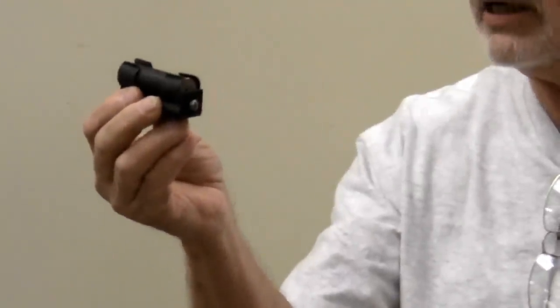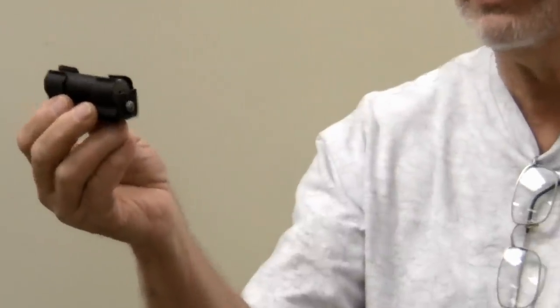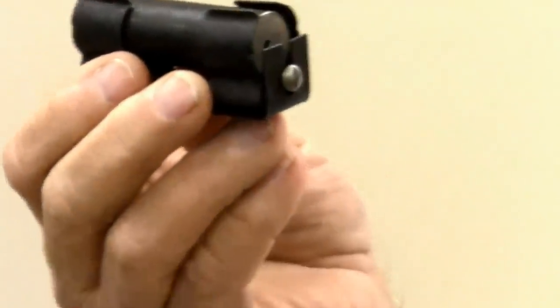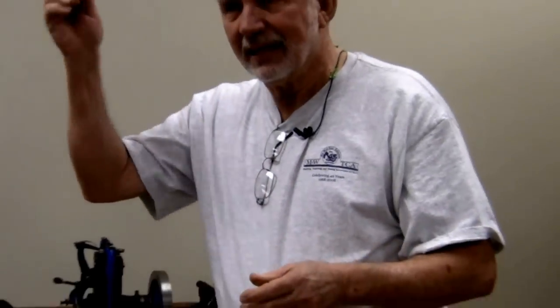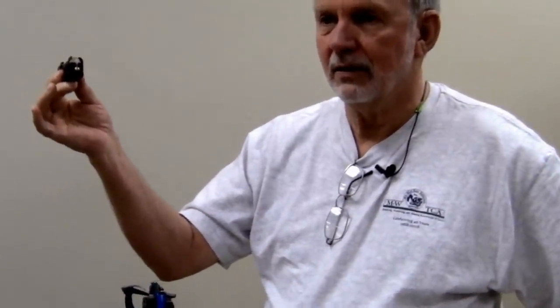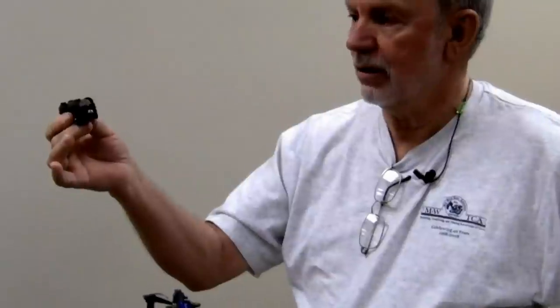I've seen this before. Who does this belong to? Do you know what this is? Yeah. Tell me what it is. I've forgotten. Can I borrow your saw? It's called a clear line. Right. And it fastens on the wooden handle. And as you move the handle up and down, there's a plunger in that. Can you hear it? And the seals are gone, but it's supposed to generate a little puff of air that blows the sawdust away from your line.